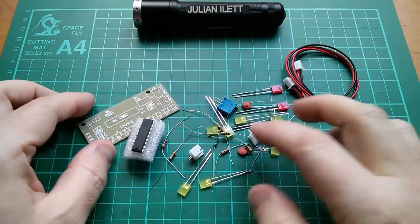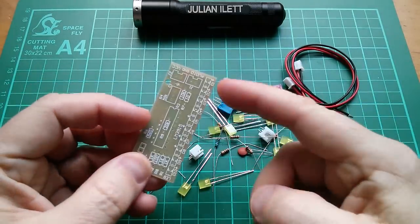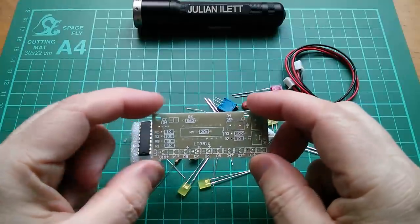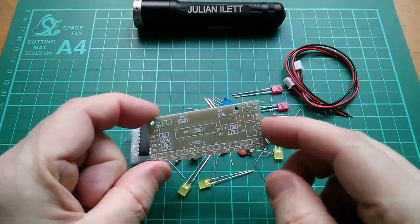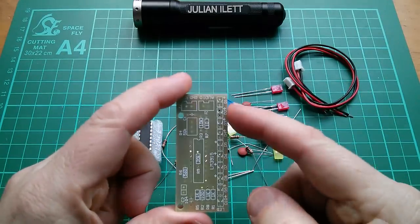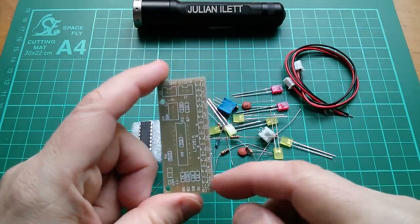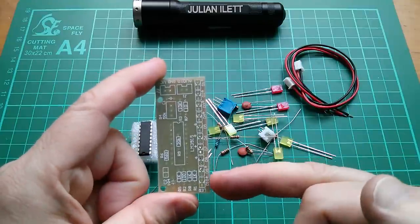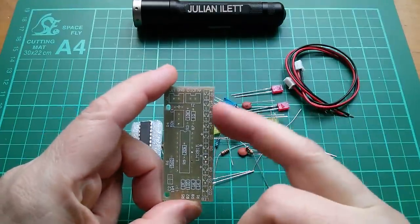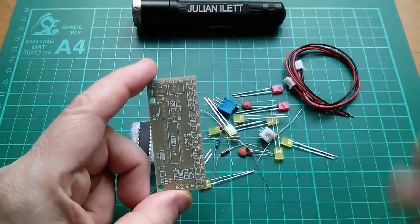What I thought I'd do is build one of these kits pretty much as intended. I might lay the LEDs out in a slightly different arrangement, and while doing that, look at the datasheet and also look at the vocoder project — that's why I bought these. The vocoder uses two of these bar graph circuits for PPMs, peak program meters, to show the peak level of the incoming audio signal.